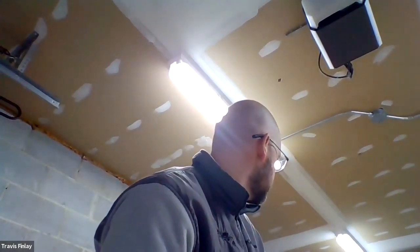I didn't see a way to... well, I went through the calibration and verified it, and that's how I set the value that I made up, the motor height value. But I didn't see a way to save or apply those settings anywhere. Yeah, it should apply when you hit continue. Okay, well then it should all be done. But $ doesn't give you any output? No, just 2 okays, that's it.